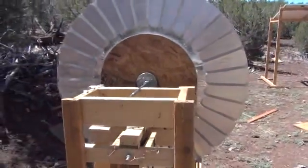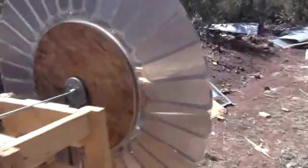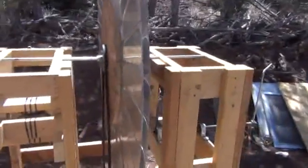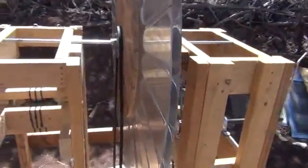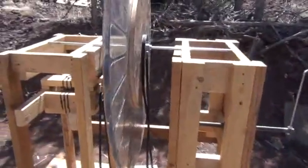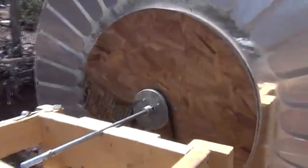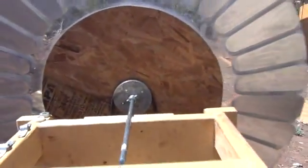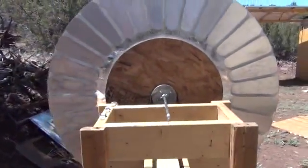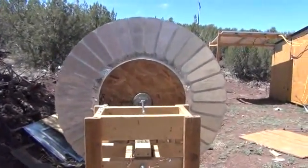The brush will stick all the way out going across here and cover a good portion of these discs — so these are going to be very wide brushes. As for the combs we're going to produce, they'll be mounted off this rim and sit quite a ways into these induction plates, probably about an 8-inch rod on either side. Once I get this done we're going to set up a monster capacitor bank, wired more like a Marx generator than a standard capacitor bank, which allows you to put capacitors in series. I'll show you a film on how to build your own Marx generator as part of this project. Until next time, this is Mr. Teslonian and the Teslonian Man Show.